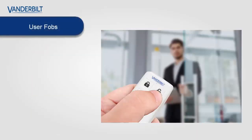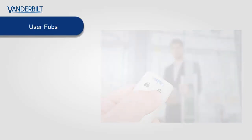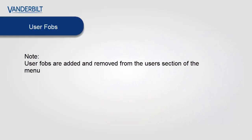The next device in our wireless portfolio is the WRMT, or the wireless remote unit. This unit is used for arming and disarming and also part setting the system. We also have an SOS or a panic function using two buttons. Unlike our other wireless devices, this unit is enrolled through the user menu and not the wireless menu as before.